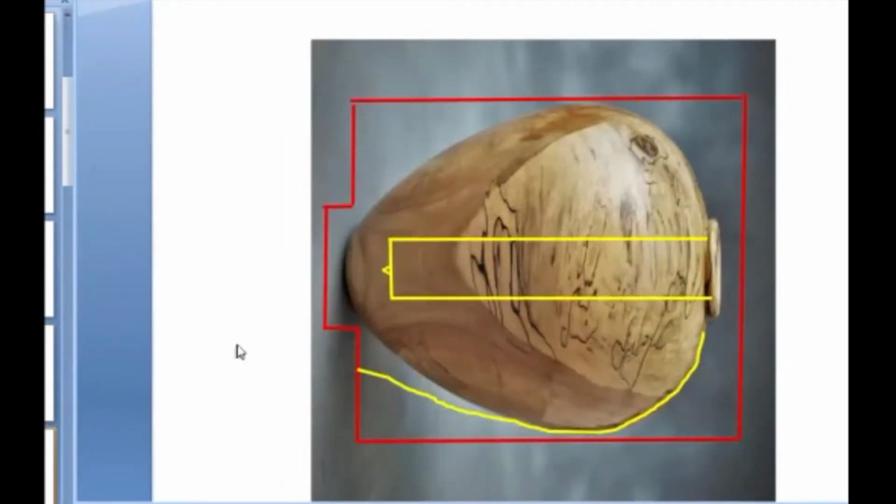Okay, so here is the piece as you would see it on the lathe, sideways. You can see that the initial block was something like this red square. I drilled a hole all the way down, but not all the way to the bottom. Actually, before I drill the hole, I do this outside shape. And the shape from here to here, including the neck area, is pretty much final form at this point. However, I taper it down more like this yellow line, where it's much thicker at the bottom. Again, because I like to keep the wood stiffer before I hollow too much.